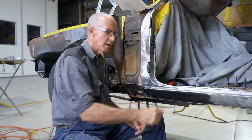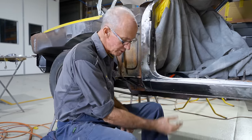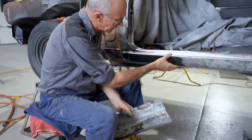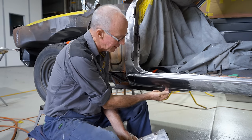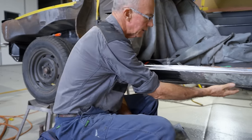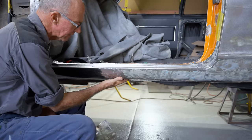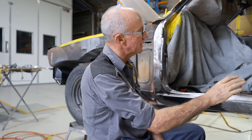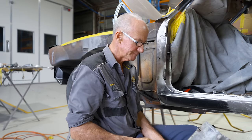Okay, so the last little bit I've got to do on this sill now. Unfortunately, we duplicated, like I said, those couple of holes underneath those sills, and this new piece I've put on here had no hole, but thinking you're doing the right thing, I put that size hole right about there under the sill. Now I've got to go and make a little patch panel for that, weld that up under there. It's also got one back right there, the hole they've bored through the sill there, so I've got to fill that one in. That's the last little bit of work I have to do on this sill. Once that's done, then that's all completely ready to be sandblasted, that whole thing there. And that'll be a real good thing because I can actually move forward now past that.